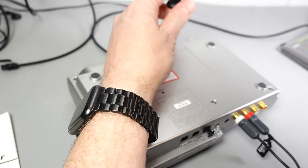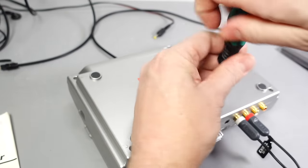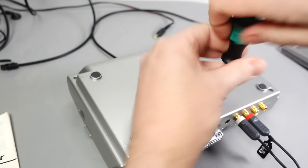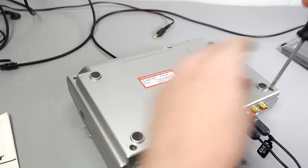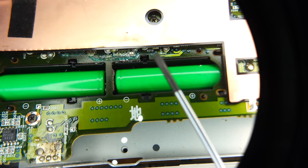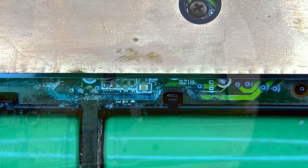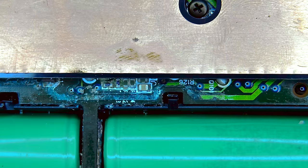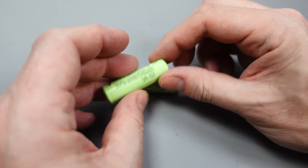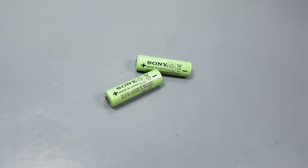Now, while I do have plenty of other minidisc recorders capable of NetMD, MDLP, high-speed CD to MD copying, and easier track titling, I still wanted to take another look inside this one to see if the analog sound issue was caused by an easily fixable break in a trace. But the answer was no — those batteries have really done a job on this circuit board. I can't even see where some of the traces are supposed to be; they've been completely burned away. It's probably a bit of a miracle this thing is working at all. A mint machine eaten away from the inside by a couple of hidden batteries — the designers never considered anyone would want to use one of these 25 years later.